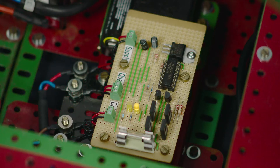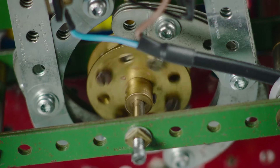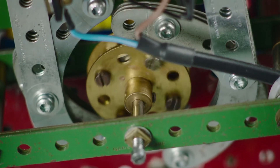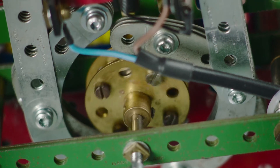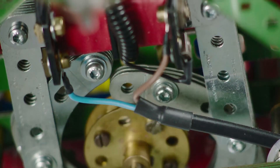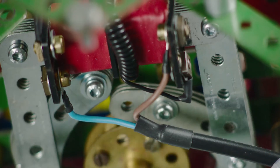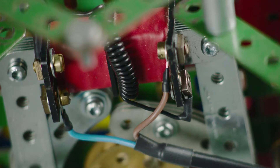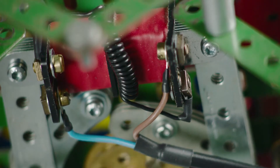The unit has an accuracy of one to two seconds a month. The clock motor itself takes the reversals from the electronic circuit. It consists of two electric coils wired in series, and they then reverse the magnetic flux between which is the rotating magnet.